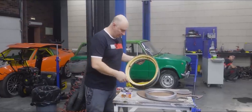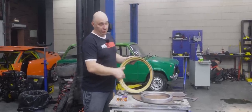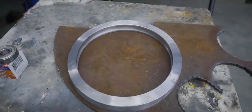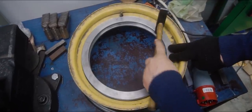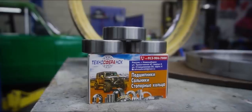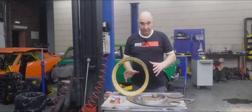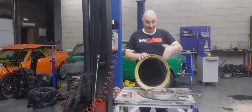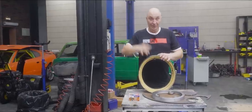Hi fellas, here's how this interesting wheel is turning out so far. I've left just the rim — we cut out the center, it's all very nice, we've ground it down. And we've machined this wonderful guide piece. It's going to be placed right here, welded in place. And here we'll have three bearings placed inside. After we get the entire assembly in here, we'll make three spokes. I reckon that as soon as we're done putting all of this together and spraying on some paint, the final piece is going to look sick.